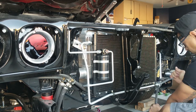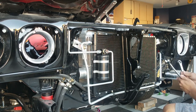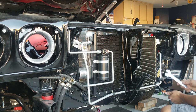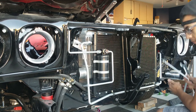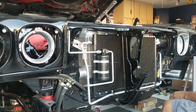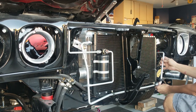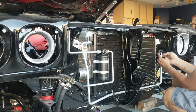Alright guys, got this side tight. For those wondering about the wrench sizes — it's a 7/8 and a 3/4. The 7/8 goes on the bigger nut side, and the 3/4 goes on the pipe side. Now we've got it lined up where we need it, and then the grommet you can just kind of work in there.